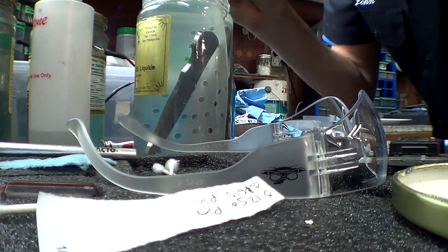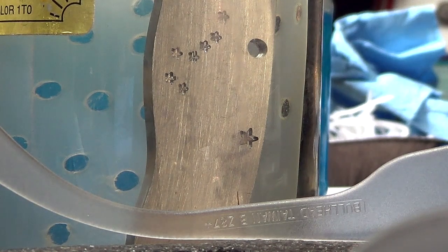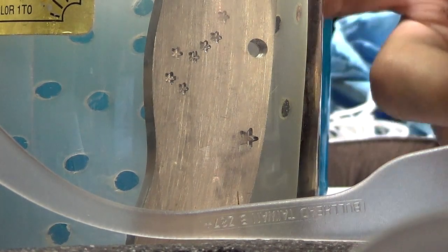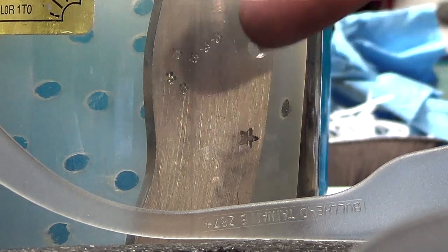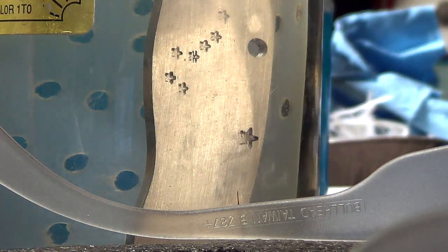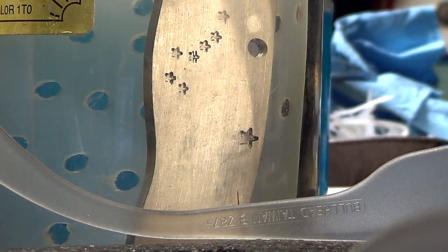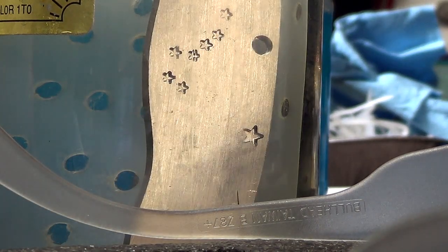Oops, I lost it. Yeah, so this isn't a how to anodize tutorial really, but basically negative goes to, I've got some old titanium handles in the back here as the cathode, a plastic separator piece, and then the piece itself is the anode. Make sure you have more cathode than anode. Minor detail. And then negative goes to the cathode, positive goes to the part. Make sure everything's touching and making good contact.